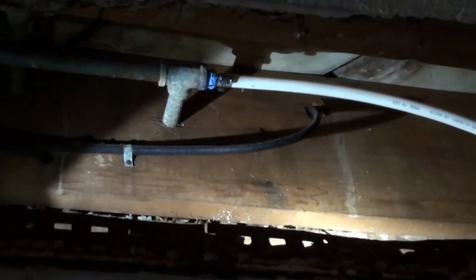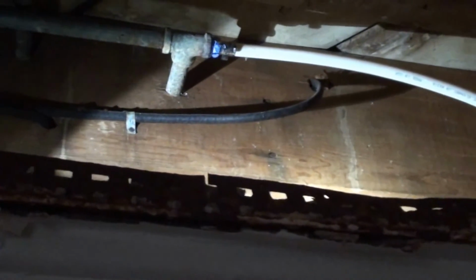The only thing you do have to worry about on the copper ones is that it's crimping it straight on. Sometimes the copper rings will crimp it on at an angle, and that will cause problems. But for the most part with the copper rings, you cannot go wrong. It's the better ring to use. As a homeowner trying to do this, just get the stainless steel, because you're going to buy one tool, 40 bucks. You're going to buy whatever rings and stuff that you need, but that tool is only 40 bucks at the hardware store. I mean, maybe 50 at the most.